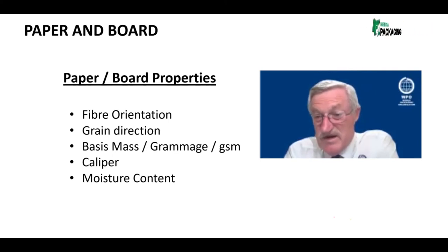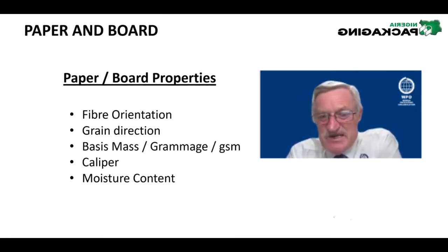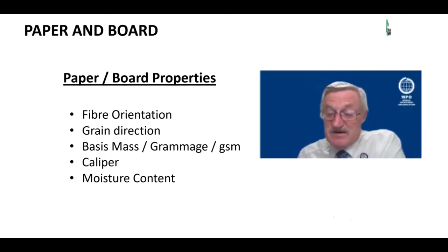You need to know grain direction because if you ever work at a paper mill or for a company making corrugated board, it's essential knowledge. We always measure paper in grams per square meter — if you cut a square meter and weighed it, that's the GSM. We never cut a full meter; we do it in proportion, cutting 100 millimeters and using ratio analysis to calculate the GSM.